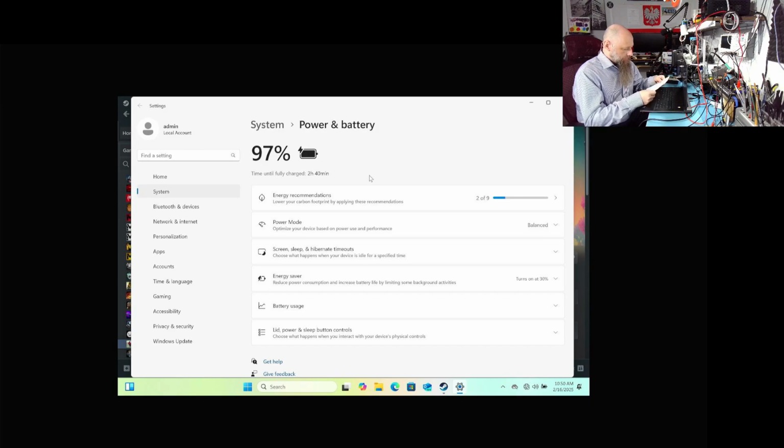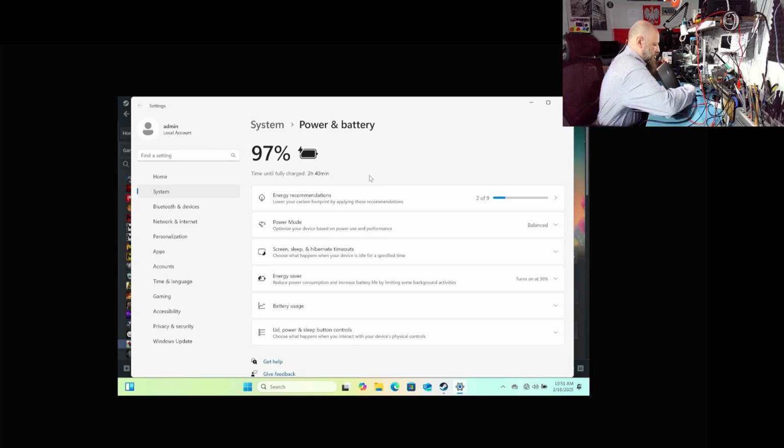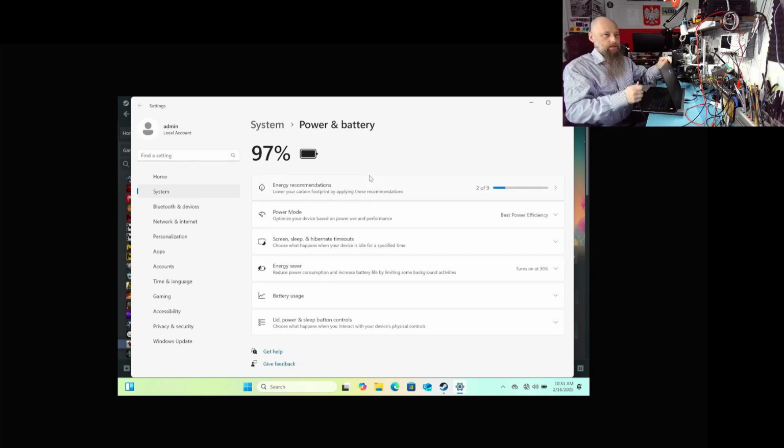Extremely slow charging, 30% every 24 hours. Yeah, it sucks. When gaming, laptop throttles power to 45 watts and blinks error code on power button. Replaced battery and the DC in adapter, and no change. So typically what happens when this happens? Number one is the adapter, the DC adapter.